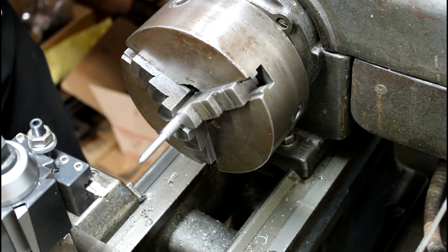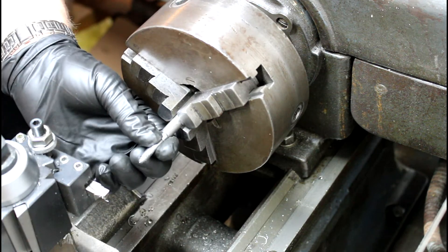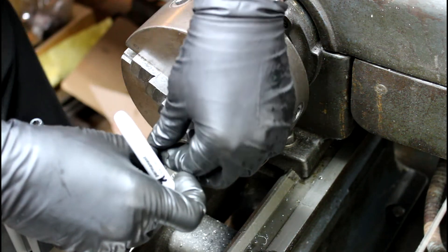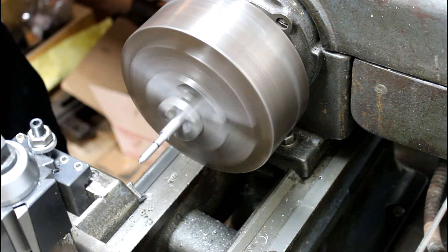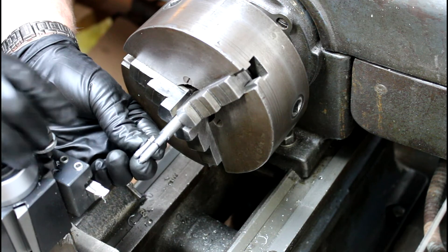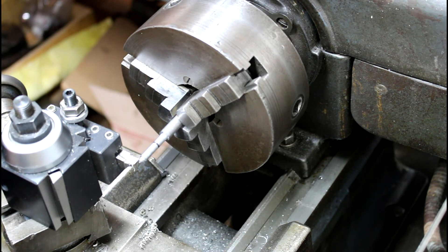Now I'm going to think about which way I want to run this guy. I think I'm going to put my collar on the inside for no particular reason at all. Then I'll have my back end for the main part of the shaft. I'm putting a mark on there just to get a general idea of where I want my collar to be. That's going to stay there, and now this side I'm going to cut down to 180 thousandths.